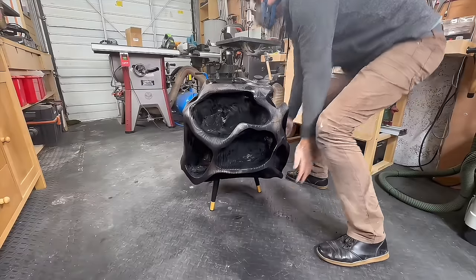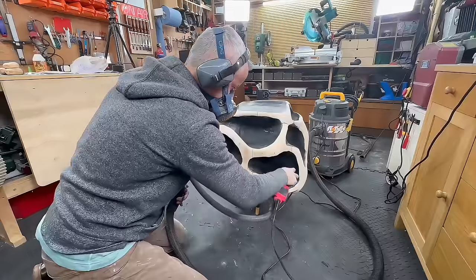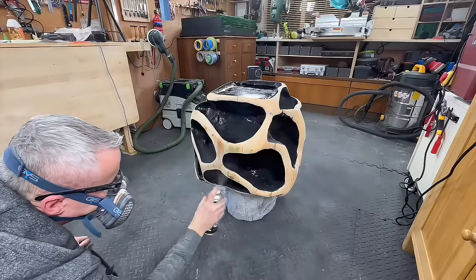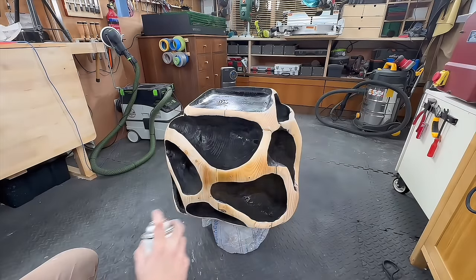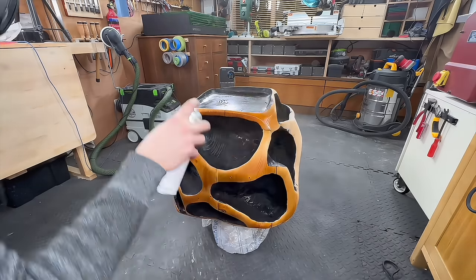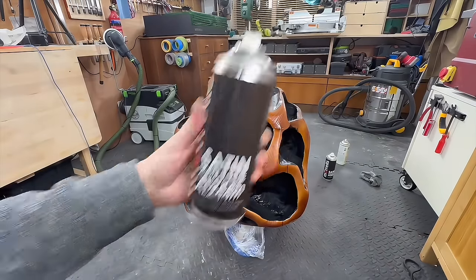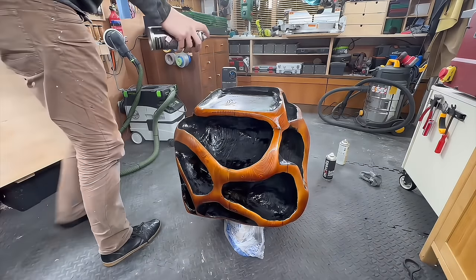These are the legs for this piece - they're made of metal so they'll help with the weight and make it much more sturdy. I used three legs not four because I think it looks much better with this style of furniture and it's much easier to level given the irregular shape. On the sanded bits I sprayed a coat of lacquer just to seal everything before the next step, which was to use lacquer toner to make this cheap wood look like nice walnut. Finally for the top coat I used satin lacquer and it was done. What a journey - I hope you guys enjoyed this video and I'm curious if you expected anything like this when you saw that pile of wood. Give me a like and subscribe if you haven't, and thanks again to Jackery for sponsoring this video - see you soon.